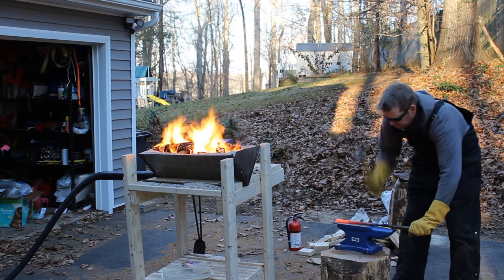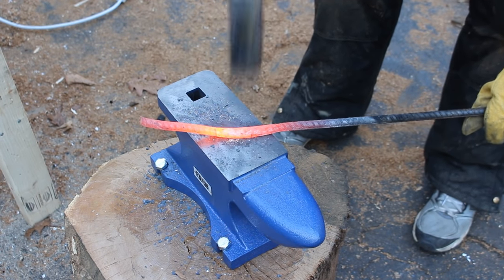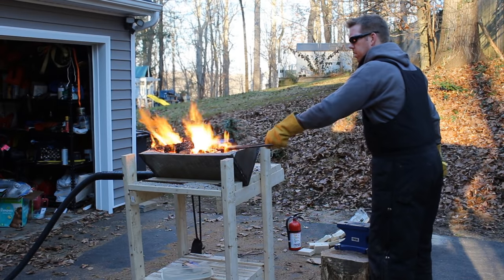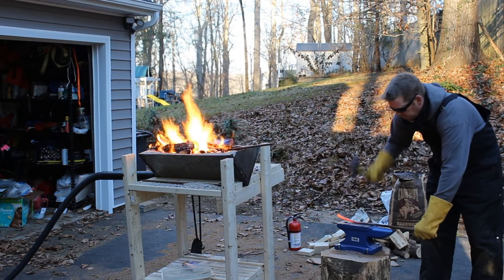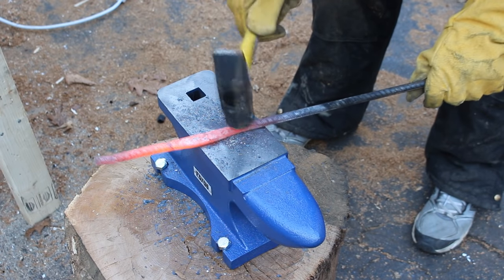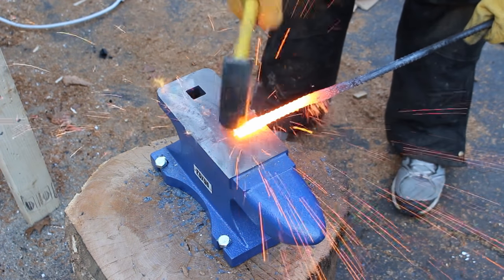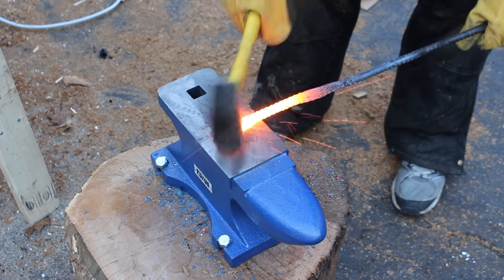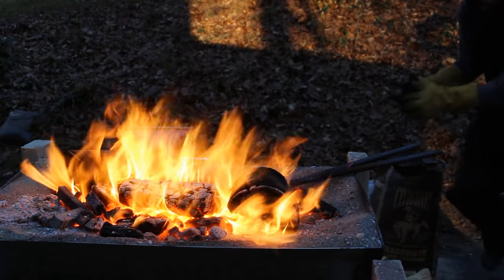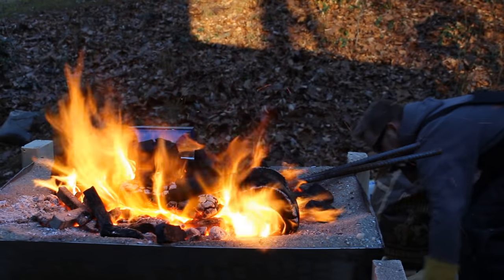The first strike is going to be about six inches from the end and you're just going to beat only one side of the iron — do not flip it over, just pound it on one side. Once it cools, put it in and grab the other one, switching back and forth: while you're beating on one, the other one's cooking. What you want is for it to be flat on one side — this is the offset for the connected pivot portion of the tongs. Then you want to flatten out the tip to make the teeth of the tongs, 90 degrees from the offset. Keep stoking the fire — that's the one downside to charcoal forges, you constantly have to feed them.